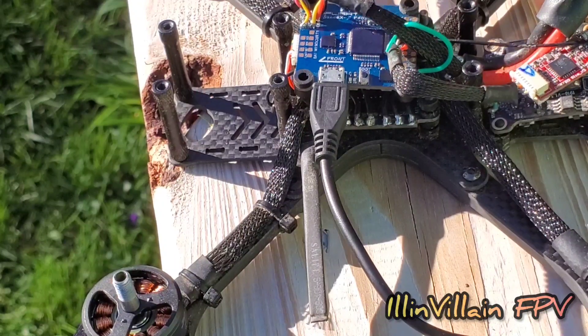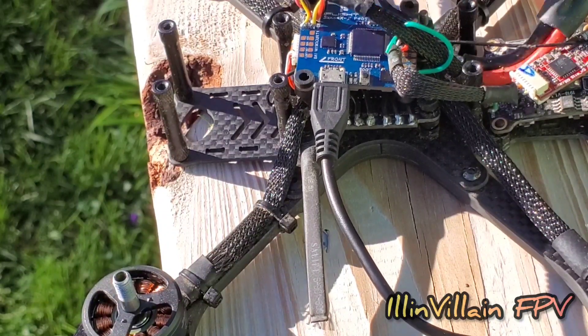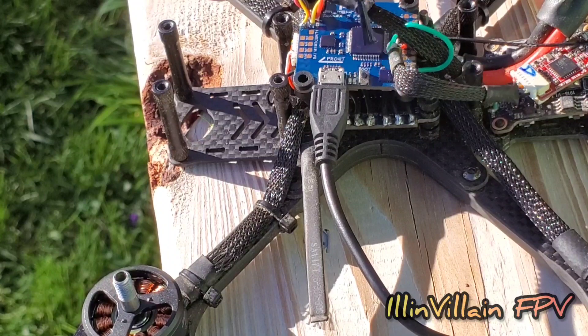You can see that it makes a little bit of a blue tint to the boards. That's the dye they put in it so you can see it with a UV light, but you can also see it with the bare eye, especially if you're outside. Just a general light coating, and make sure you do both sides of the boards. Do your FPV camera, your receiver, flight controller, VTX. Don't worry about the motors — the motors will be fine.